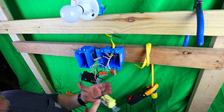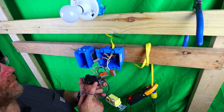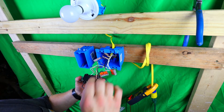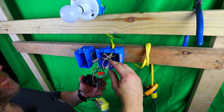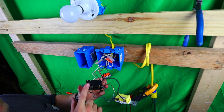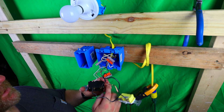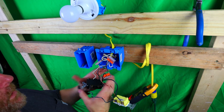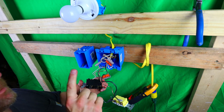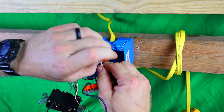When you turn the power on, the GFCI sends power out the load side. So power comes in on the line, goes through the GFCI, and comes back out the load side on the wire going up to your light. The neutral for the light is also under this wire nut here — so I have three wires joined. The problem is this: when you turn the switch on, the GFCI sees the hot it needs but it doesn't see the neutral going up to the light on the load side — there's an imbalance. So it just trips itself out because you must have a hot and a neutral on the load side.